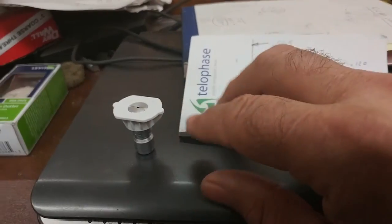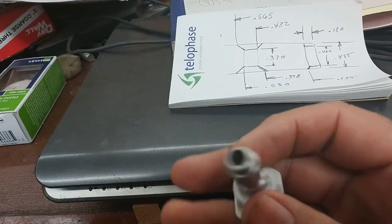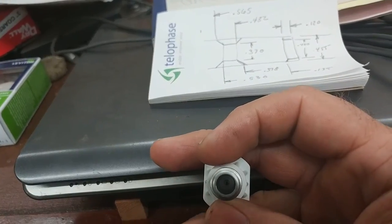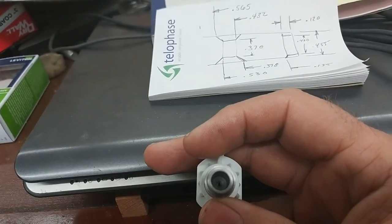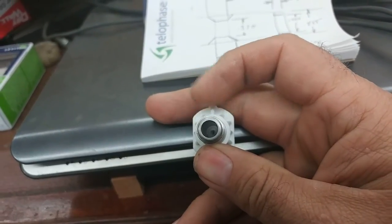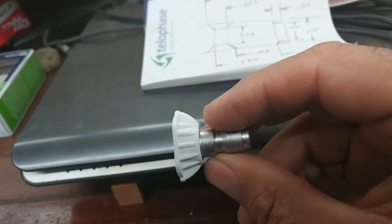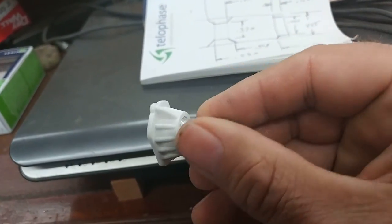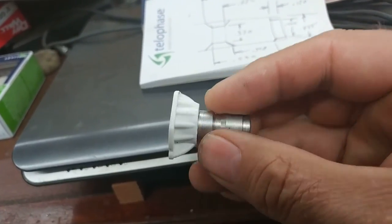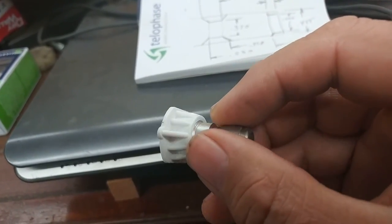This only has a pretty thin wall thickness back in the back, but I'm going to just put like a 3/16 hole in there. And then I'll have to put a side hole. Maybe I'll just put a couple side holes and I can stick it in there, kind of work it around. And do it that way. A couple 1/32 holes. Clean up between the sheets.